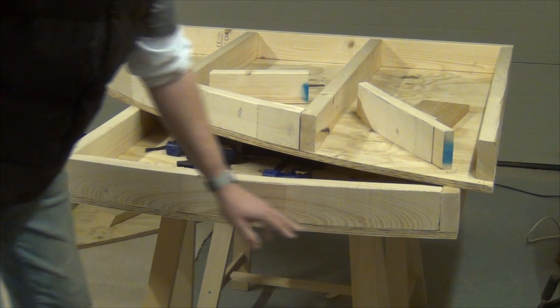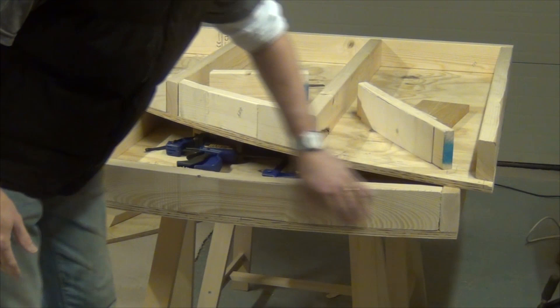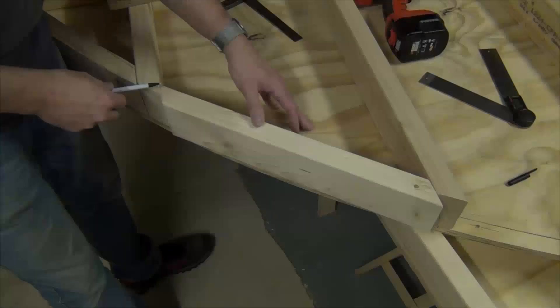The next thing I'm going to do is to drill some pilot holes to hold the curves on, temporarily fix them with some undersized screws, put the lid on, drill and screw that down. Then I'll flush up all the curves. Then once I'm happy with all the sections, I'll one by one disassemble them and reassemble with construction adhesive and full size screws.